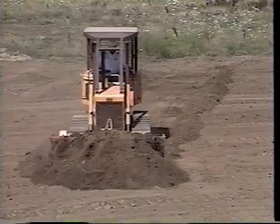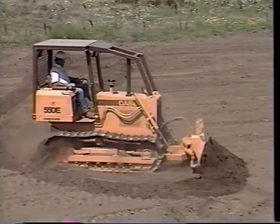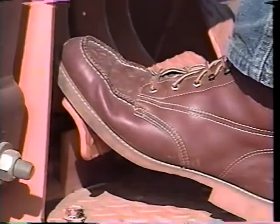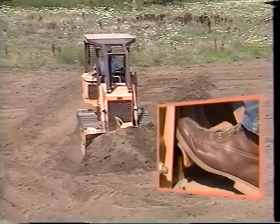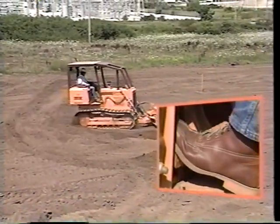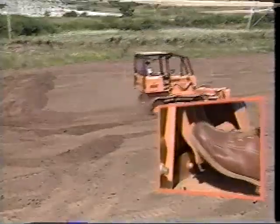life is left. The brakes are very low effort and easy to feather for a slight turn or fully depressed for a sharp brake turn. The operator can use a heel-to-toe action to engage either brake pedal. As he depresses the pedal, the transmission will first declutch or disengage the transmission. Then as he pushes further, the brakes will begin to engage. This lets the operator use the brakes for turning under any job condition while maintaining full control of the crawler.